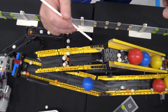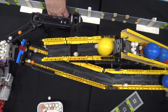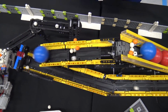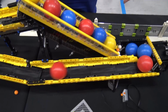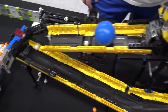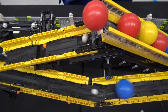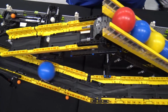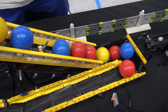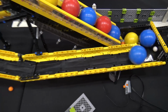Because if the balls get stuck down the conveyor belt, that's always a challenge. Conveyor belts don't like that, and next your gears are going to break down. And then you need new gears. That's what makes it sometimes expensive. Well, not the gears, the motors, they die too. If you are blocking the motor, they can handle it a little bit. Like a kid uses the motor in Lego Technic models, it will be on and oops, it blocks and it will be switched off. We are not looking all day at this specific one, so if this one blocks, it might take maybe a couple of minutes before we see it, because the circuits get larger and larger every time. Well, the motor does not like that at the end. It will break down. So that would be a pity.